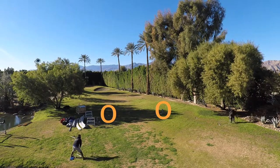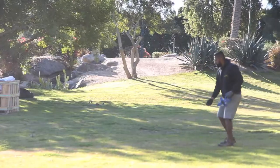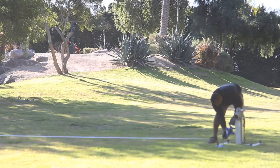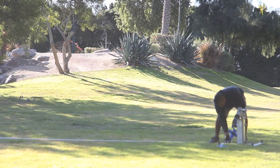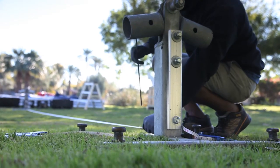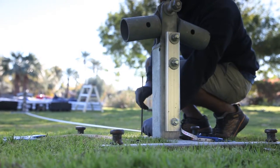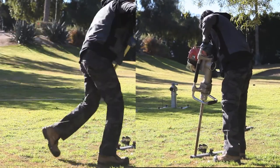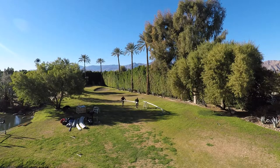Place the base assemblies according to the survey. Since the bases will probably be pushed out of place during the assembly process, ensure the correct location is well marked so you can adjust the frame back after assembly before you secure the anchors. Secure the perimeter anchors per survey.